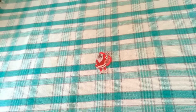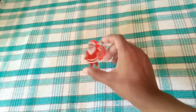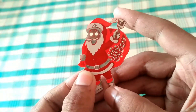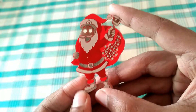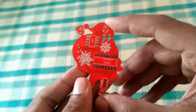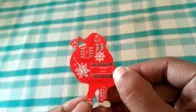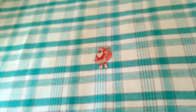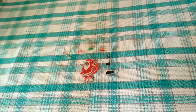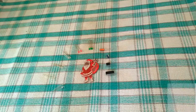This is my PCB Santa Claus project that I made for upcoming Christmas. The board looks really nice and cool just as I wanted it to be. All the copper layers and silk screen layers used for detailing are placed perfectly, although it would look better if the surface finish was ENIG instead of HASL, but that would add to the overall cost. The components needed are: CD4017 decade counter IC, 555 timer IC, 10 microfarad capacitor, 10K ohm potentiometer, and 10 LEDs of various colors.